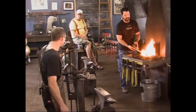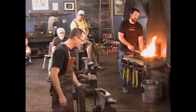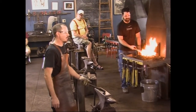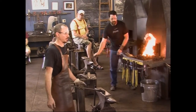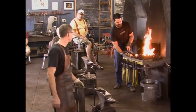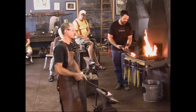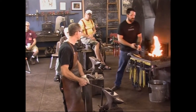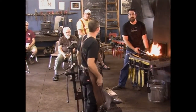I've had too many close calls with ill-fitting tongs. Getting hit in the face by hot metal is not fun. Having a piece of hot metal fly out in the middle of your craft festival and land somewhere amongst the audience is less fun. If the tongs don't fit, by all means stop and either make them fit, or modify the tongs. They're tools to do the job, so make them do the job. Modify your tongs so they fit, or make the right tongs. You want to be in control of the material.